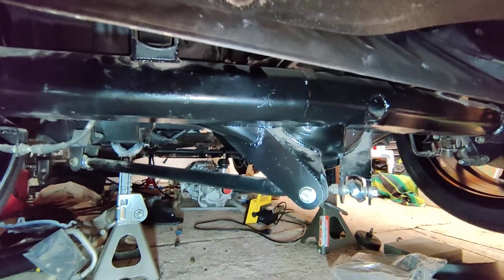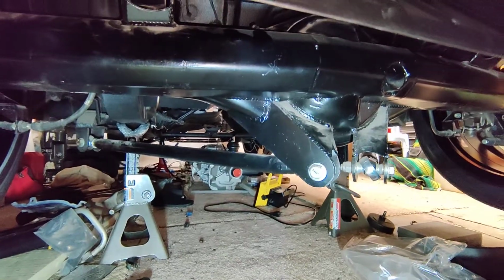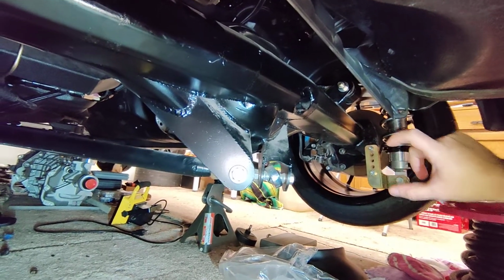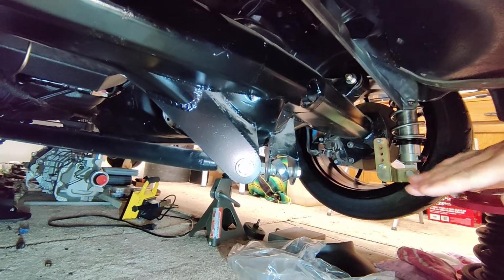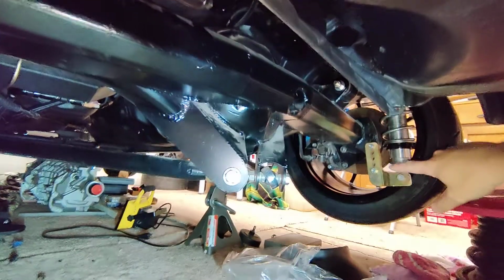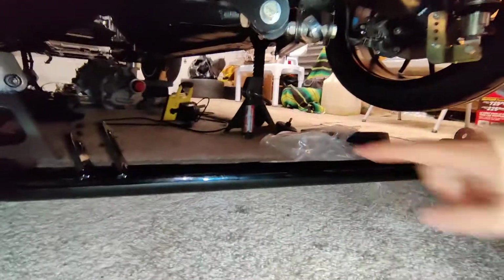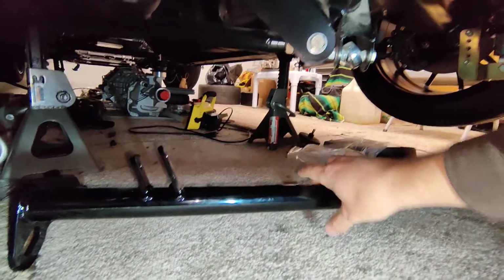Okay, so after a little bit more consideration, we're learning that running the sway bar, anti-roll bar, off of this is putting too much side load on something that should be able to go free form in a back and forth location, and these are very small by comparison. So I actually do have a very flat surface here, and I have a 1.5 inch traction bar from the Civic that is exactly the diameter of what I would need.